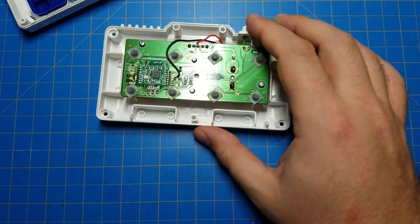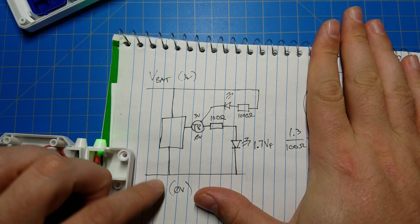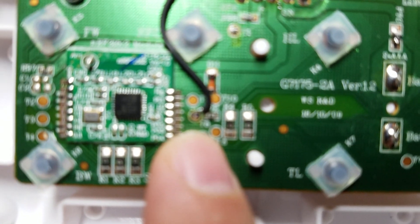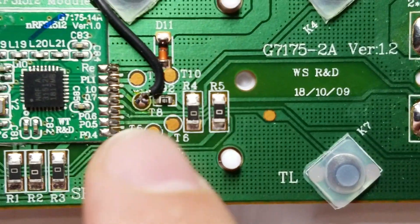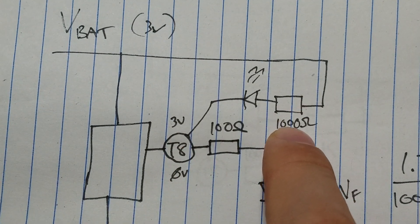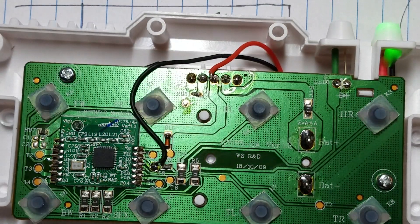If you want to wire this up yourself, don't do it the complicated way. You have your battery, you have your microcontroller right there, and you have your T8 test point. That test point goes to the negative side of your LED. Throw in a 1,000-ohm resistor on either side of the LED — it doesn't matter which side. Then the positive side of the LED needs to go to the power right there. That is your entire mod.